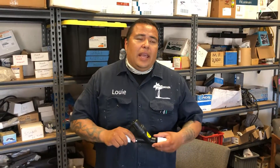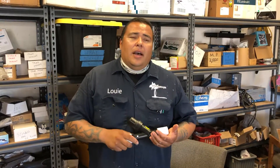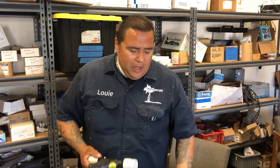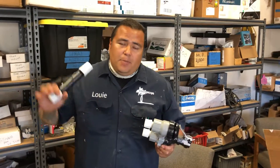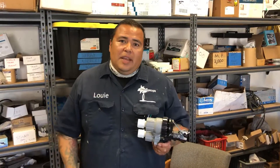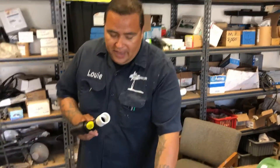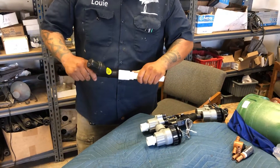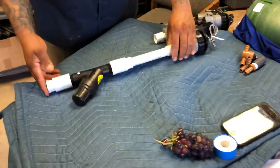This particular valve is going to irrigate a zone covering about 400 linear feet of 0.6 gallons per hour at 12-inch spacing — so it'll be about four to five gallons per minute. This valve paired with this filter addresses the flow needs for the particular drip zone. All your sizing needs to be done appropriately. This one does have a couple of reducers that get it down to three-quarter inch pipe for the install.